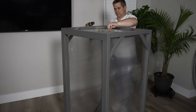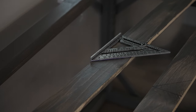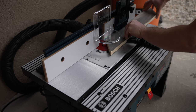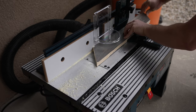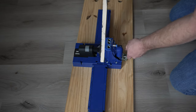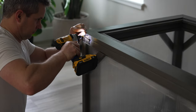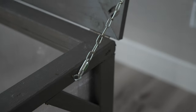For the lid frame, I used 1 inch by 4 inch boards, cutting two sides to 52 inches and the other two to 29 inches, with 45 degree angles cut off all ends for aesthetics. Using a router, I cut quarter inch grooves on the short sides of all the frame pieces to create an insert space for the top panel. If you don't have a router, you can frame in the top panel with furring strips after centering it on the lid frame. I then drilled pocket holes into both ends of the 29 inch pieces and assembled the frame. After staining, I attached hinges on one end, a handle on the other, then added eye hooks, chain links, and chain to hold the door upright while open.